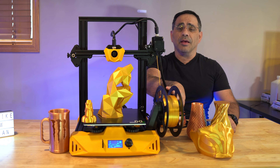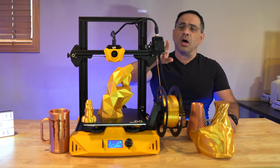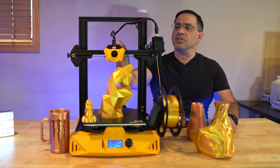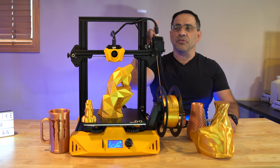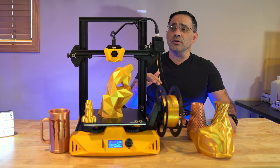There's another part of the Artillery Hornet that really stands out, and that's the filament loading and printing solution. Your filament loads on the side — that's pretty standard — it comes up into a dual drive, but then it goes into an integrated Bowden tube connected to your printhead. This is all integrated with the wiring, so you have no additional cabling. Now, it has some benefits but also some challenges.